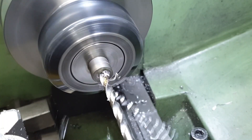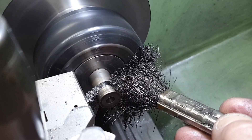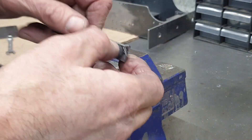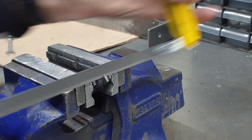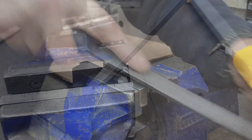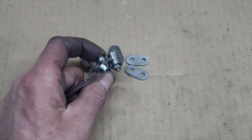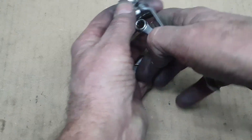For all the buttons, I use some half-inch bar, which I drill out to 5mm and then part off into 5mm sections. My intent was to case harden each of these buttons, but I don't think I heated them up enough. I only got them to a good orange colour before quenching them, and they certainly didn't harden up. Despite that, I still bolt the buttons in pairs around each of the holes and use them as a guide to saw off the excess and then file the stays to shape. Despite my rather amusing failing at case hardening, the buttons have lasted — they've certainly reduced in diameter slightly, hopefully not noticeably — but I've managed to get all 6 parts filed to shape.